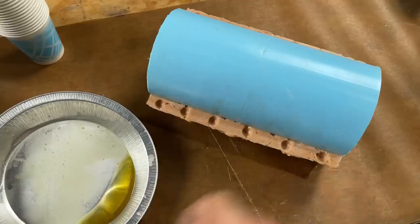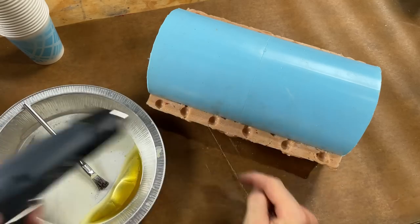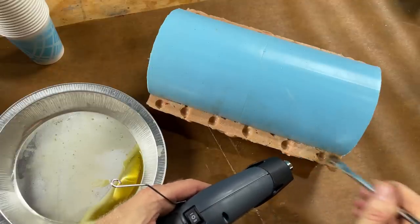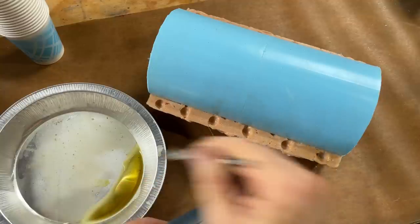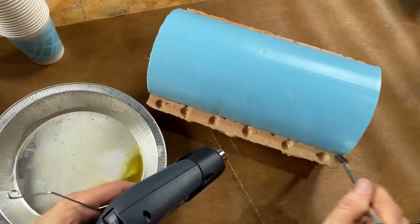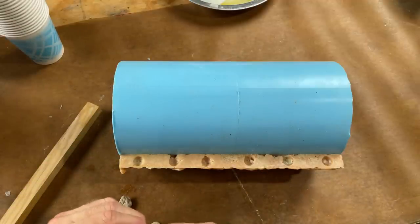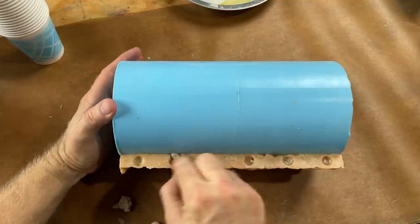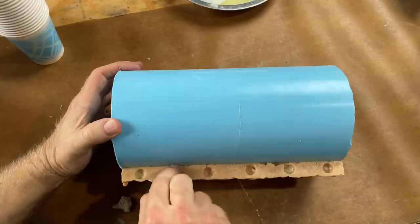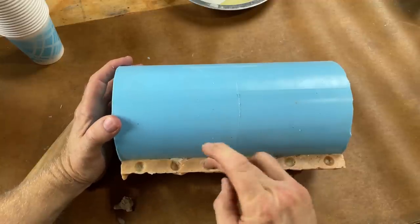Time to put some wax on these parting lines — I got it all liquidy. I don't need to put wax on the rubber, obviously. I just need to put it on the plastic, because I want there to be no chance whatsoever that the second coat — the second side to this shell — could possibly remotely stick. And what will guarantee that it won't stick? Our old friend beeswax. In this half of the mold there are all these rough bubbles. They don't matter at all to the integrity of the shell, but I don't want to cast them into the second side because they could lock. So I'm going to fill in all these little bubbles with oil clay. Another genius use for oil clay.